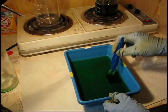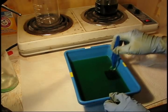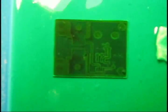Make sure all the gloss material and paper has been removed — most of it will be removed in the earlier step, but you want to ensure the etchant can really get in there and do its job. The board has been sitting in there for a while, and you can start to see the removed copper wash away with each agitation. Check any spots that are potentially suspect, like the insides of vias or between fine traces, to make sure those are etching. You can just gently rub those areas.